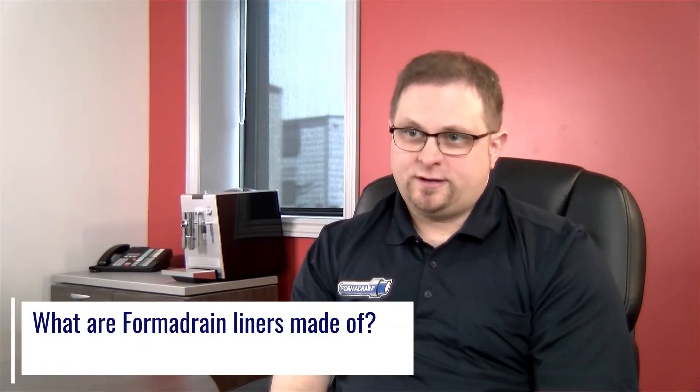Liners are made out of fiberglass and epoxy — proprietary epoxies. We have three kinds of resins: one used for standard sewer, one used for industrial applications like process piping, acids, caustics, and petroleum products and oil, and the third is a 60-day open time resin used in pre-wet applications where we build our own liners. We send it to the contractor that's installing — it was built in our shop to our specs, then sent out ready to install. The contractor gets it, installs it, pulls it in place, and cures it in place.